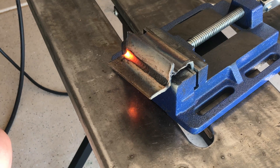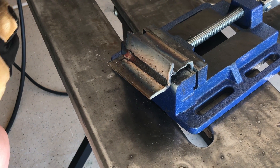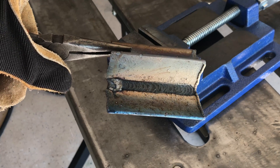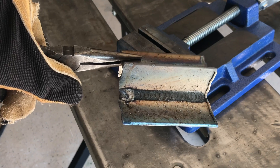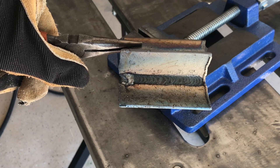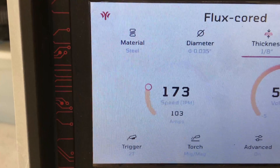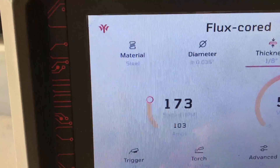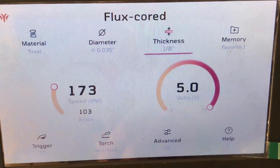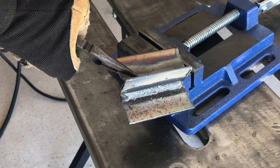It was definitely hotter. It did increase it — apparently according to the screen this time it was increased five volts. There's a look at it before I clean it — looks good so far. It changed the amperage to 103 from what I think was 74 or so. So it was definitely much hotter. And there's the plus five with the manual control. Yeah, that came out real nice.